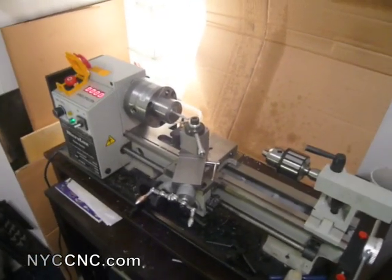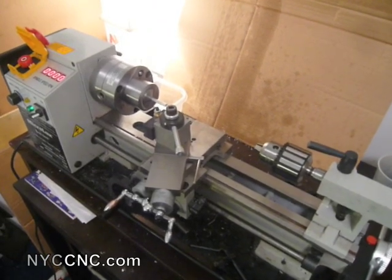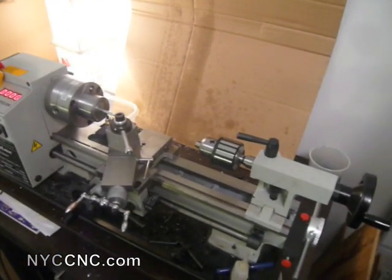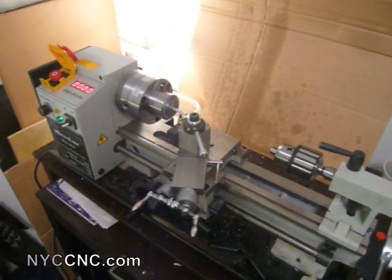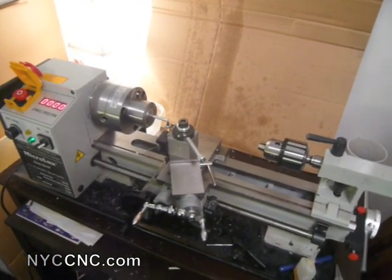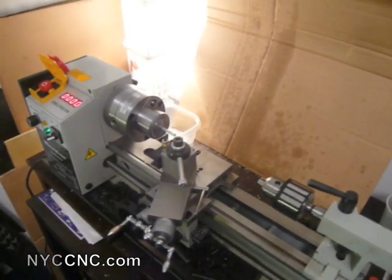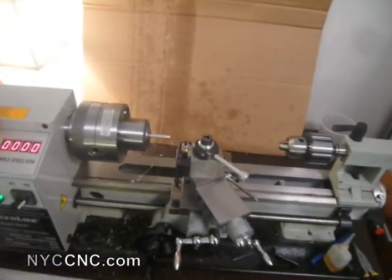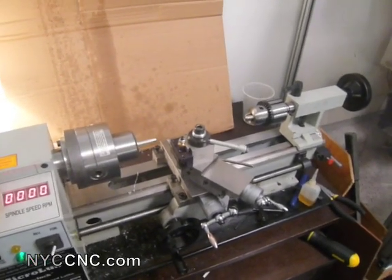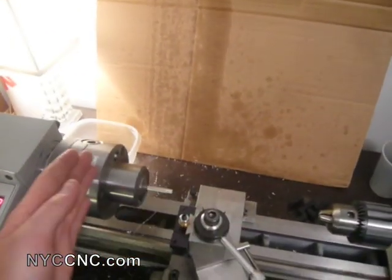I believe in his description of the product before you buy it, you'll see some about it. I made the whole thing on my lathe and on my drill press — I did not use my mill, so that can be done. The stock was a couple of pieces of aluminum, a couple of pieces of drill rod, and a couple of tap sizes. Not a lot of cost in materials. For me it was probably one of the more precision-demanding projects I've had, because you do have to hold plus zero and minus about one or two thou on some dimensions, which can be tricky when holding that tolerance on both the cross-angle and the depth of the part.